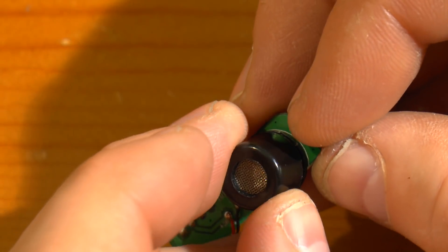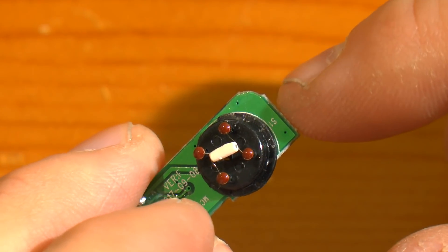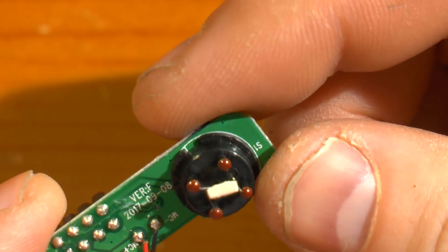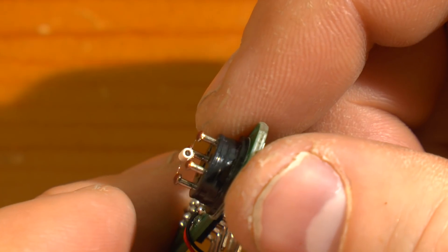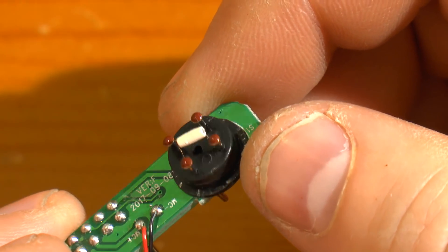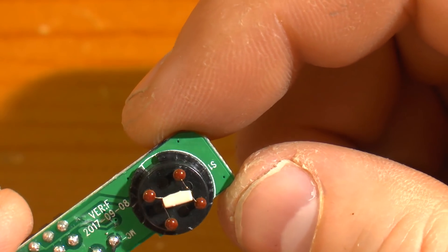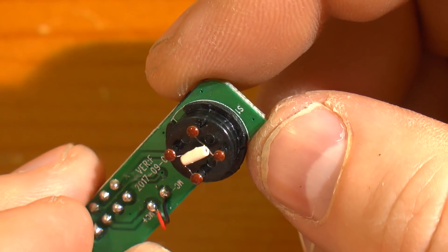There's not much to see in here — I've managed to pry the lid off. The camera will zoom in a little further but doesn't want to focus. You can see these wires just go into what I assume is a catalyst. One pair of wires will be for the heater and one for the sensing. I don't know an awful lot about this thing, so I'm not going to profess to. But that is the sensor — that's the heart of it all.